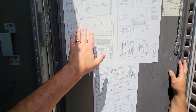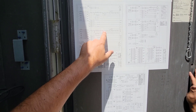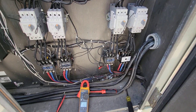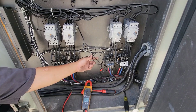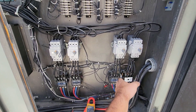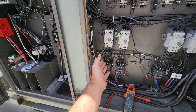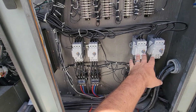When we should have seen that 120V here and we didn't, and I saw that 50V — it really stood out as weird to me. And I'm still slightly skeptical, but when it actually turns on I'll be less skeptical. That 50 volts — something's weird. But that's what led us back to here. We're running! Circuit one first stage, now circuit two second stage — that was our problem. We'll get that auxiliary replaced; this will get us by. That's on the second stage compressor, so it's going to bring on 1B and then 2B very last — the whole machine would have to be at 100% load for you to even call that circuit.